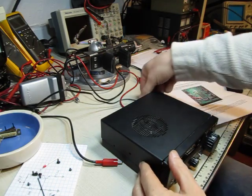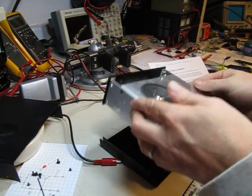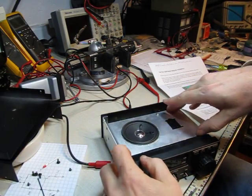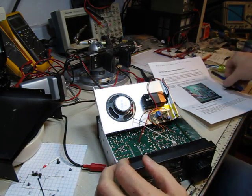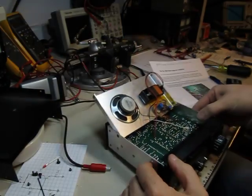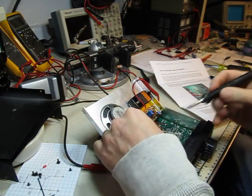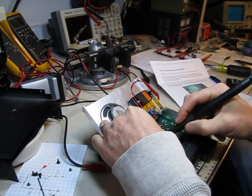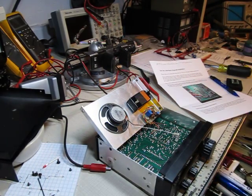The upgrade is really easy. I shut the unit off, pull the power from the back, and I've already taken the screws out of the case, so I can pull the top and bottom apart. The first thing is to remove the battery since it won't be needed anymore. I tilt the board up and unsolder the two wires for the 9-volt battery — number one and number two — and the battery is out.